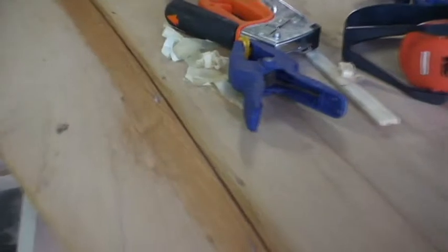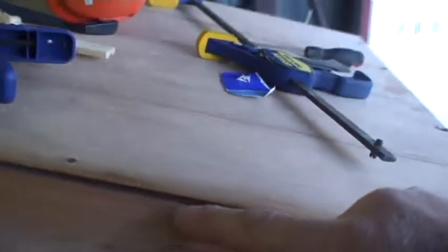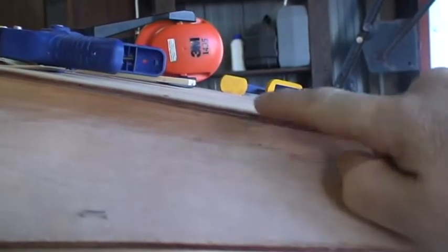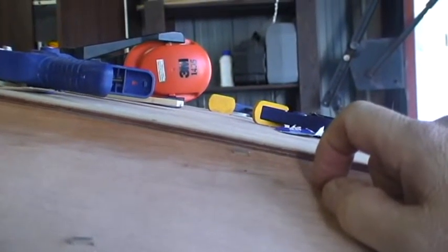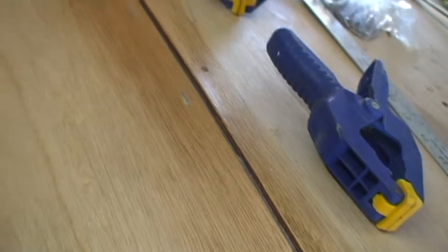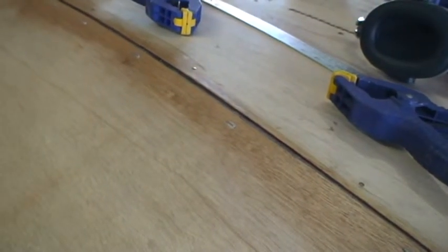The bilge panel's now on. What I'm using is about a 14mm staple. It sits itself reasonably proud of the wood, so these are easily removed with a pair of pliers once everything's dry. Looking at that gap between the panels, as you can see it's got a nice bead of glue down there. There are some places where I had to put a little bit more glue in to fill it. I just rubbed this down with epoxy solvent to take off the glue that was sitting on the panel — it's a lot easier to come off with solvent at this point than to try and sand and file it off later.